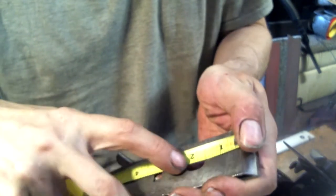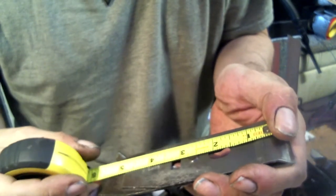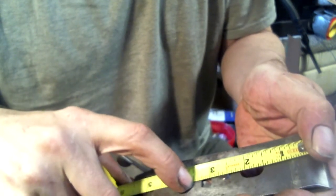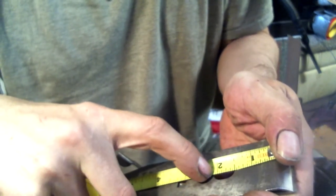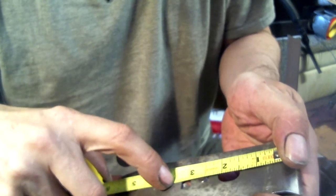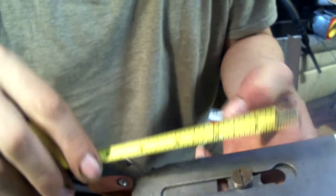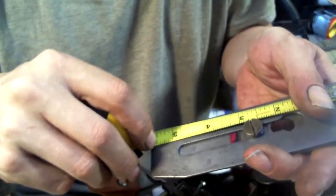None of the rest of this matters except for the oval, obviously, for the lock lever. This needs to be three and a half inches — one and a half inches to the beginning of the slot, up to two inches, two and an eighth. Then three and a half inches to the top of the lateral slot. The linear slot needs to be five and a half inches on a new blade.